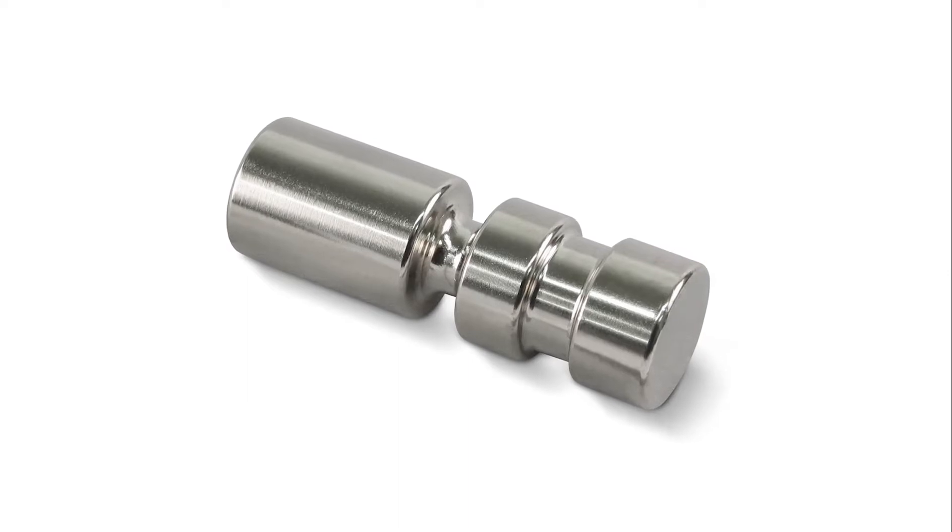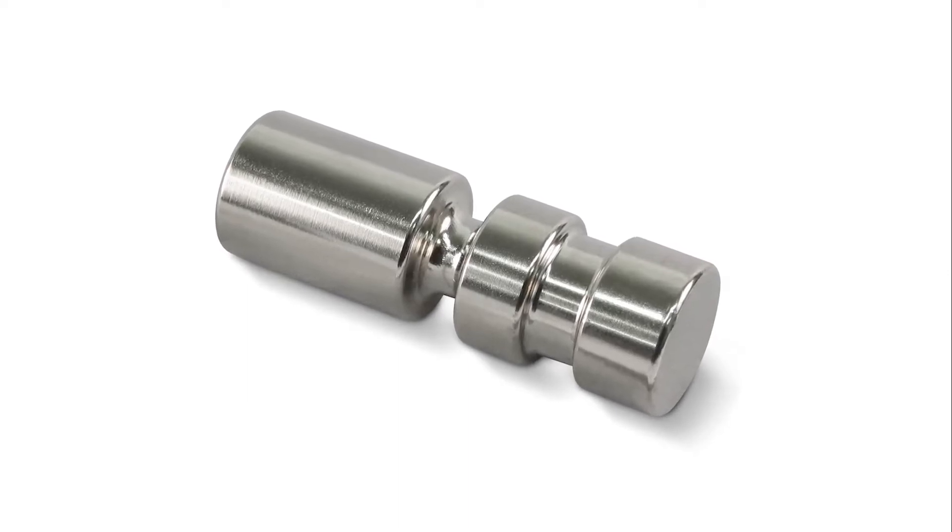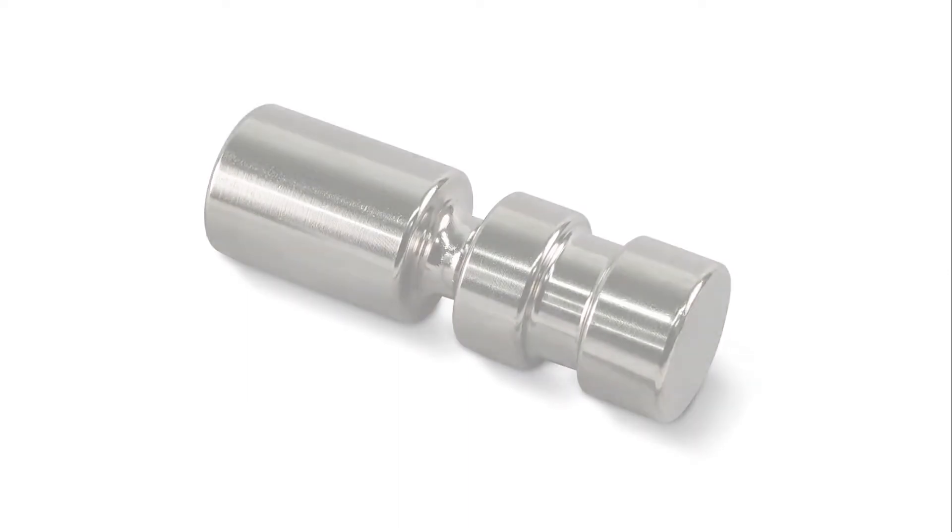Hey there, it's Alan with Brentwood's Polychem Solutions team. In this episode, I'd like to focus on shear pins. The shear pin is notorious among mechanics and operators since it's the component that makes them go out in the rain, snow, or dark of night to fix. However, a broken shear pin deserves more critical insight than it typically receives. Trying to fix the issue by simply replacing that pin with a B7 bolt or other high strength substitute puts your collector at risk of catastrophic failure.